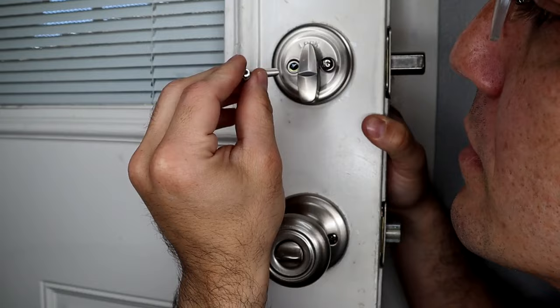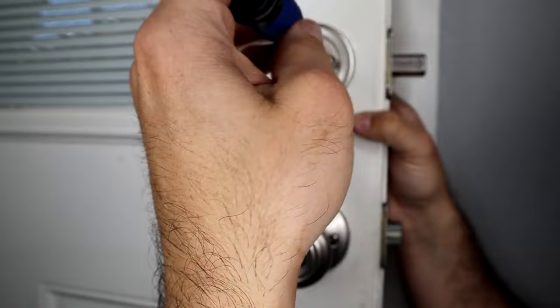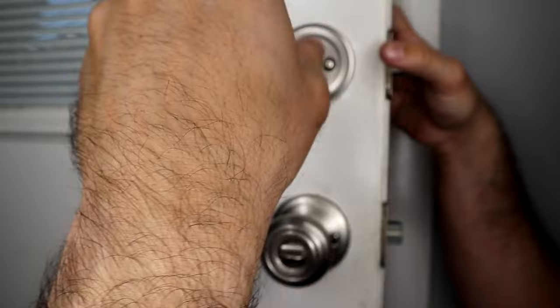We should be able to drive our bolts right through, and with everything lined up, we can go ahead and tighten those in place. You want to do this by hand so that you can make sure it's in line and you can feel that you're grabbing on where you're supposed to, which you can't always do as well with a drill, especially if you go too fast.